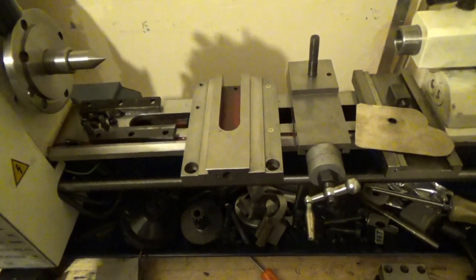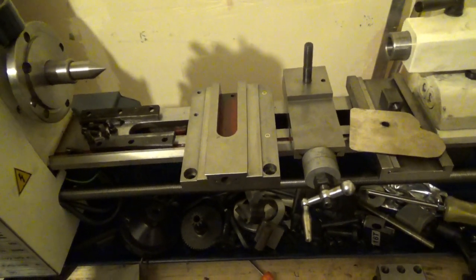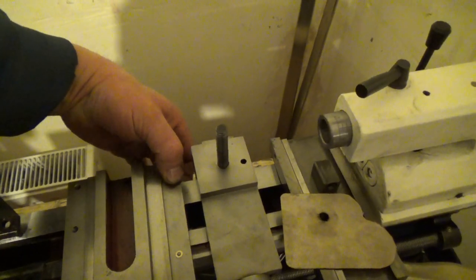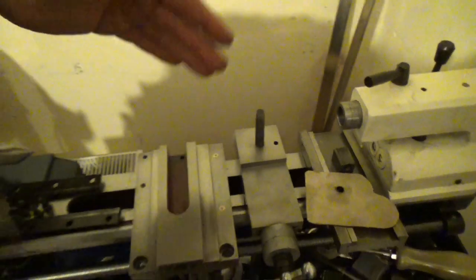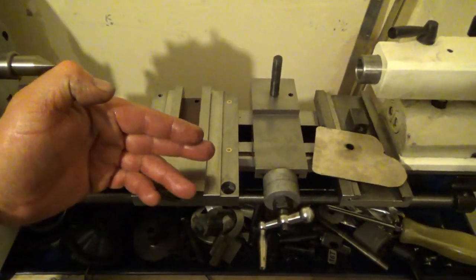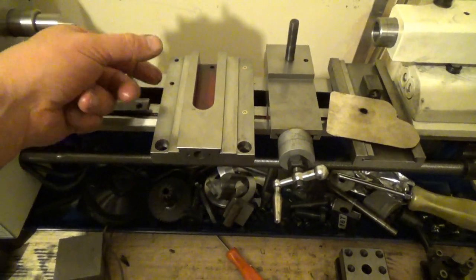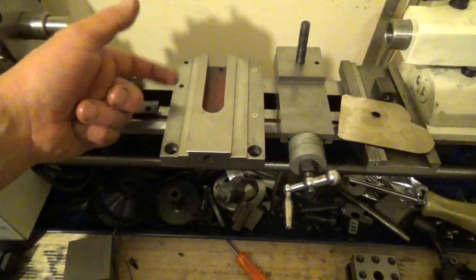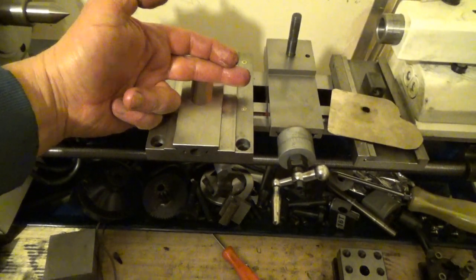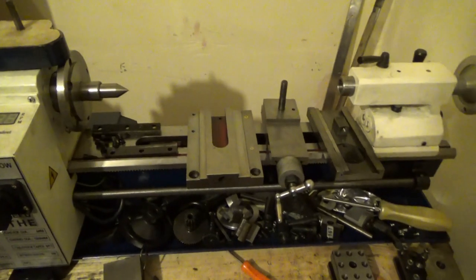The bare essentials don't need that much steel for a carriage lock — it could literally just drill a hole at the back and pinch onto the back of the carriage. I'm thinking a piece of steel at least 10 to 20mm thick, hanging down slightly with a spring to hold it away, pivoted on a collar bolt that locks tight but leaves it loose at the front, spring-loaded, with a clamp at the back to bring it up.